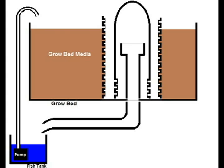In this diagram you can see the three parts: the media barrier, the bell, and the standpipe. The media barrier has slits cut all along the side so water can flow through to the bell. The bell has slits cut only at the bottom so water can flow through to the standpipe. The slits at the bottom set the minimum height the water will remain when the bed has been completely drained. The standpipe, which is completely covered by the bell, has a drainpipe coming from the bottom so it can drain directly into the fish tank and also aid in creating the siphon effect.